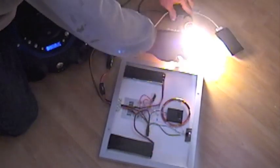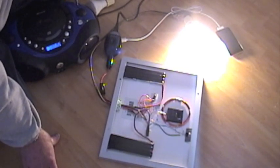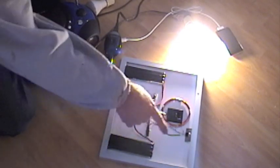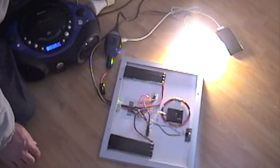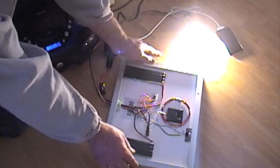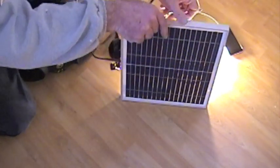You can just unplug these — that's drawing about 250 milliamps. The solar panel will charge these two batteries without overcharging. This panel puts out 18 volts and these, fully charged, are running about 16-17 volts, so it's not going to overcharge. You don't need a charge controller in here.